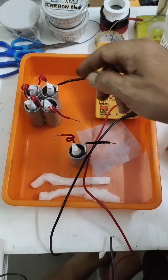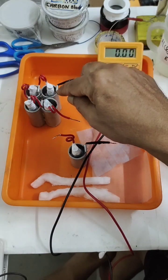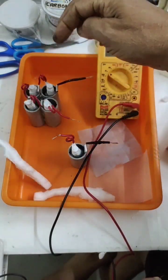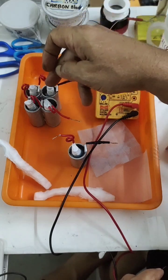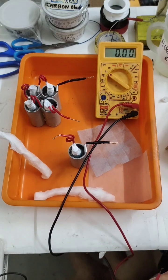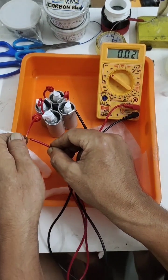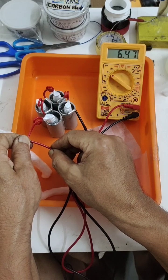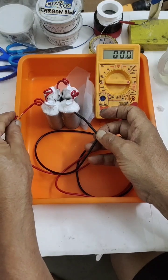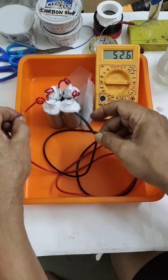So 1.7 volts confirmed. Now I am going to pour all the electrolyte into the four-in-one cell connected in series. You can see the positive of one connects to the negative of the next. I will also place ceramic asbestos packing to ensure proper insulation so cells do not short-circuit by touching each other. After pouring, the cumulative voltage of the four series cells is 6.47 volts.